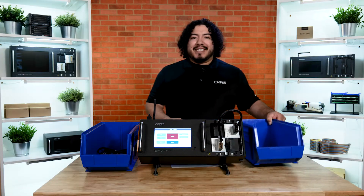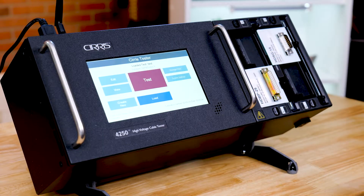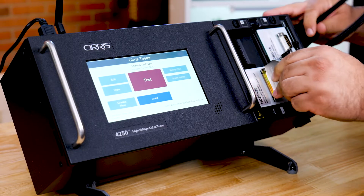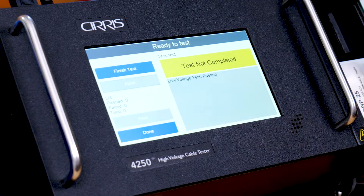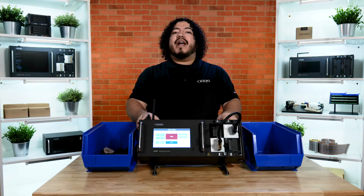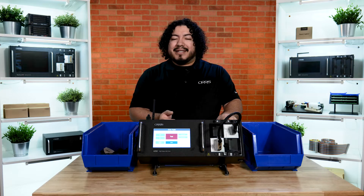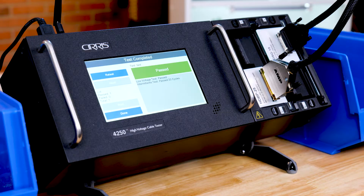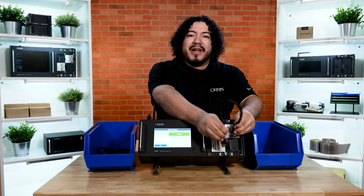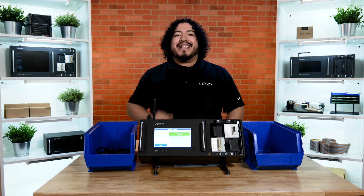You're now ready to begin testing. Remove your known good cable from the tester. Grab your first cable from the batch and attach it to the front. With the cable attached, go ahead and select Test. The tester will run a low-voltage test. For this demonstration, we've also included an intermittent test, at which point you can manipulate the cable and help expose any faults in the wire. As no errors have been found, the cable has passed. Go ahead and disconnect your cable from the front, place it in your good batch, and you're ready to test your next cable.